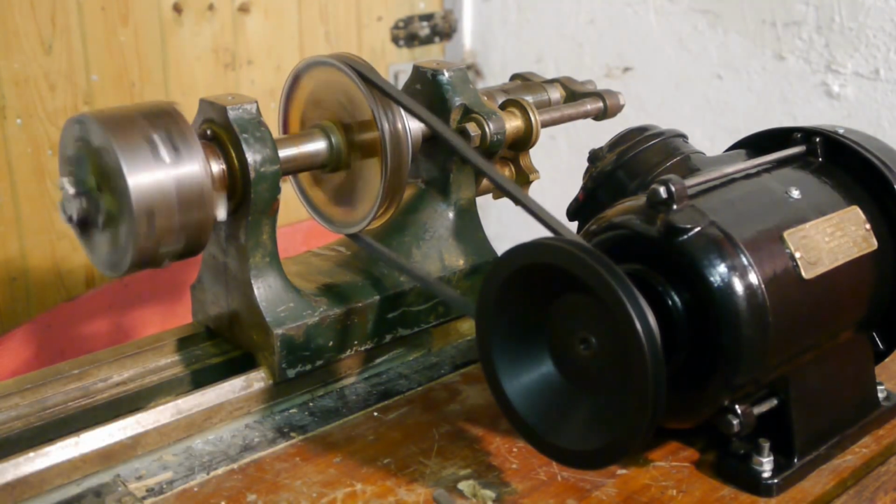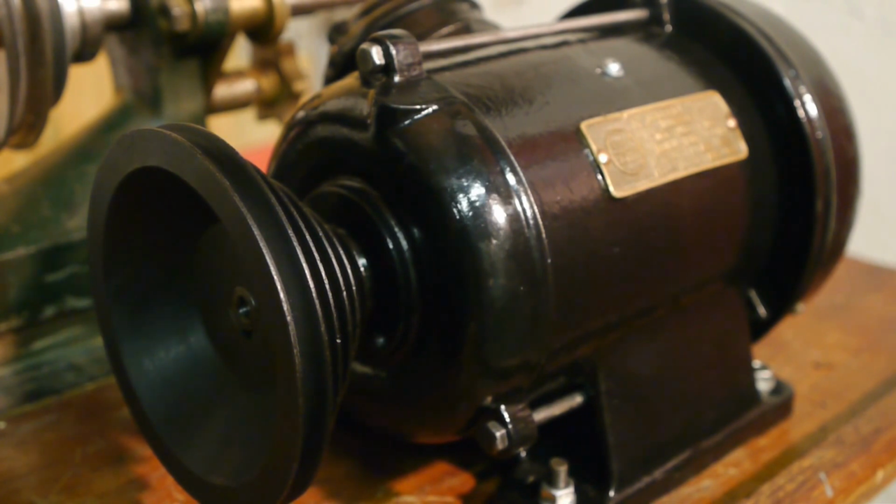This is the motor running at 20 Hz, and I can stall it quite easy. 30 Hz, no problem. And here is what a motor sounds like without the lathe running. This is full speed, 60 Hz. I will probably try gluing the bearings in place, but I think I will need to look for another motor.